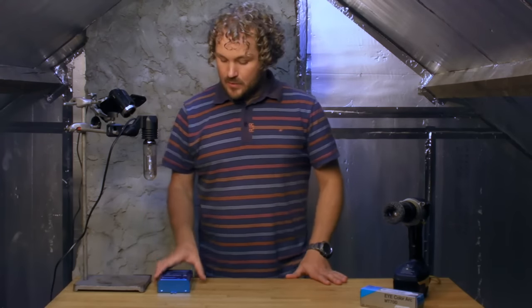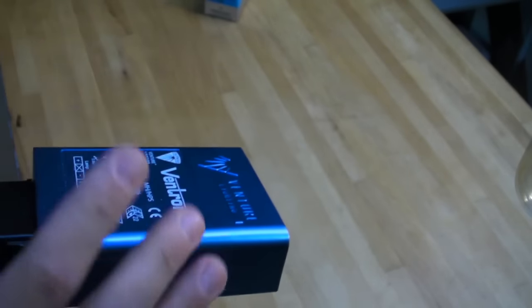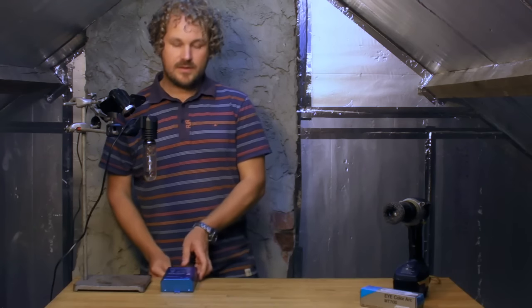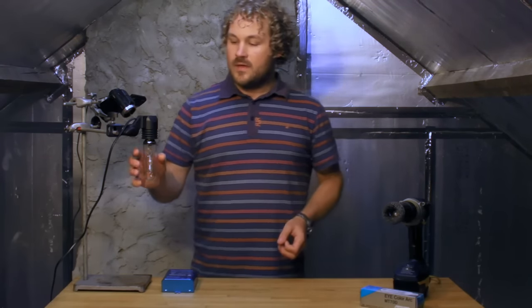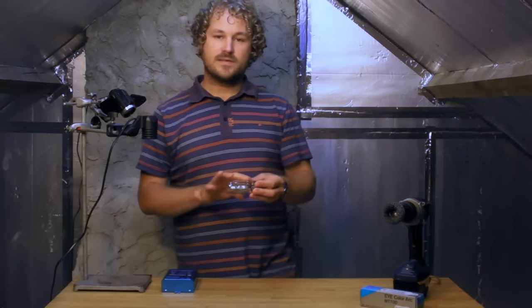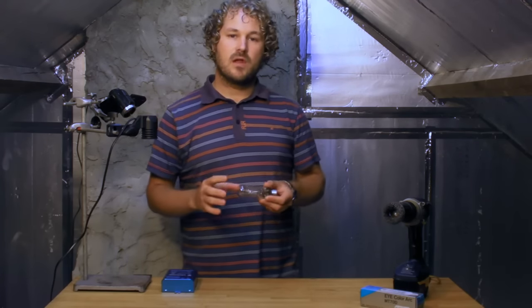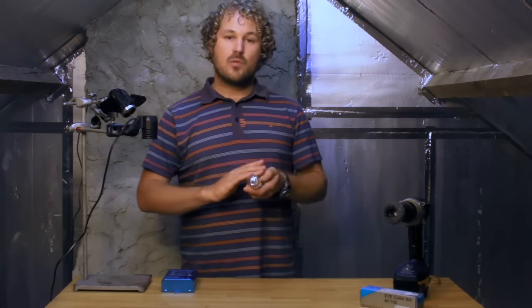If you do get this bulb, you'll need to run it with a ballast. This controls the charge of the light. It needs a very high voltage spark to get it going. Now this bulb, it comes with a filter that blocks out the infrared and UV range, which of course normally is not wanted. But you can actually remove that filter.